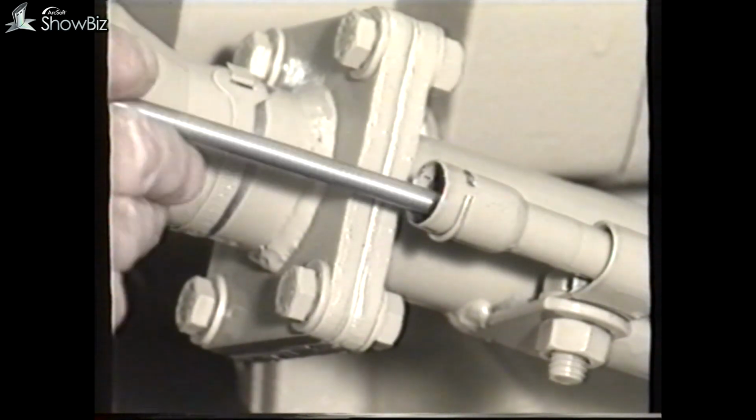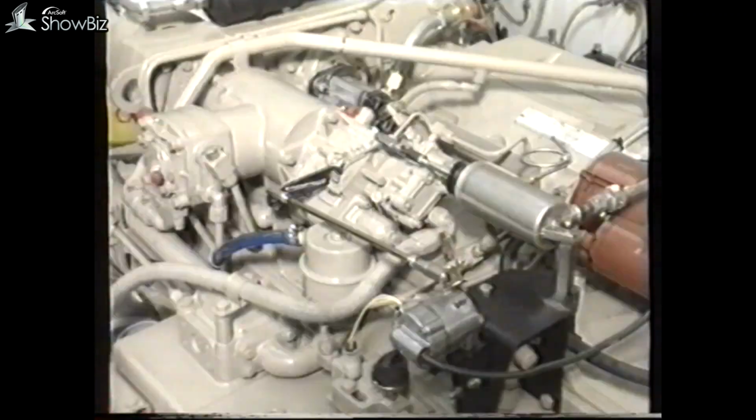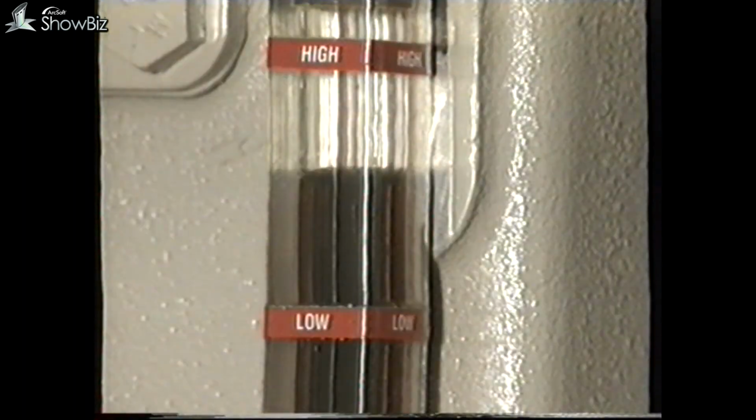Therefore, if the engine is filled to the maximum mark when cold, the oil level will ultimately be above the recommended level, which can result in oil being thrown out through the breather pipe. Remember, therefore, always to check the oil level when the engine is at normal working temperature and immediately after shutdown. On the later engine ranges, an oil level sight glass is fitted to the sump as standard to supplement the dipstick.